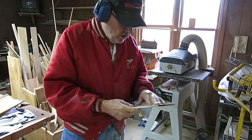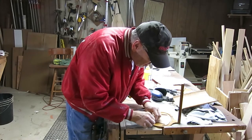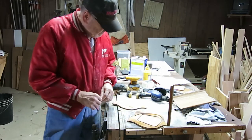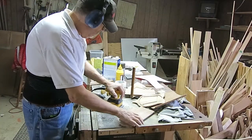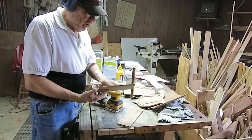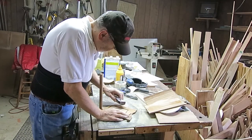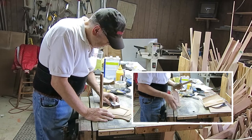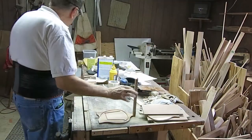Now it's a matter of just cleaning it up and getting some finish on it. You can take a single edge razor blade and scrape like this and it will clean it up. I think I'll have to sand this a little bit. I'm going to keep working here, sanding and cleaning. I've sanded all the pieces with 120, now I'm going to sand them with 150, and then I'll block sand them with the grain with 220 and then I'll be done. When you do your final sand, you always want to sand in the direction of the grain — that way the scratch marks from the sandpaper don't show.